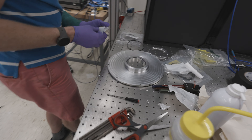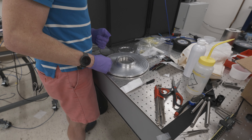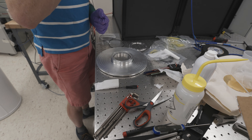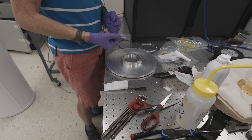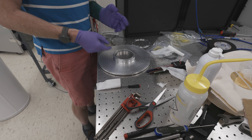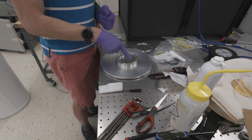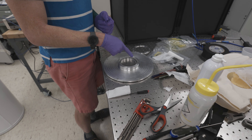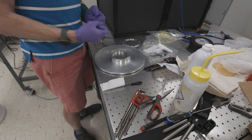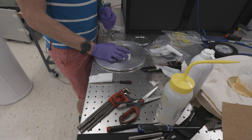Just using the face seal. It's a nice piece of fused quartz there, very clear. Because I was nervous, we went and did FEA on the lip pressing on the quartz, and it's okay. That's why I got it so thick — I did the math before I ordered it. I was more concerned about the sharp part of the aluminum acting as a knife edge into the glass. But the glass is a lot harder than the aluminum, so it should be okay.